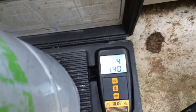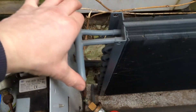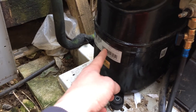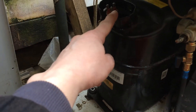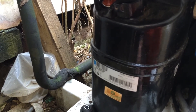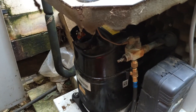Just seems a lot of gas for the size of the system. It should be on pump down or have a crankcase heater or something on there. There's nothing, so if it's got too much gas in it, when it starts up it can pump a lot of oil and liquid, and that can smash the valves up. Which would go with the symptoms we've got, because it's only about six years old — it's not that old a unit.